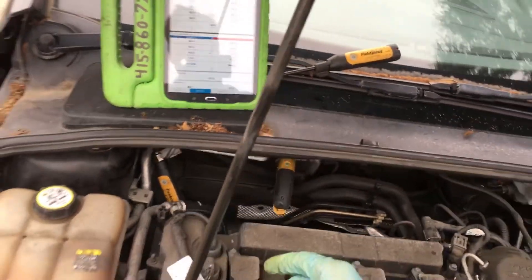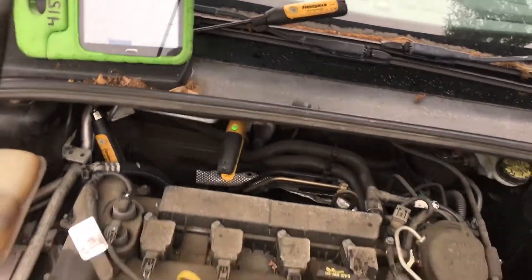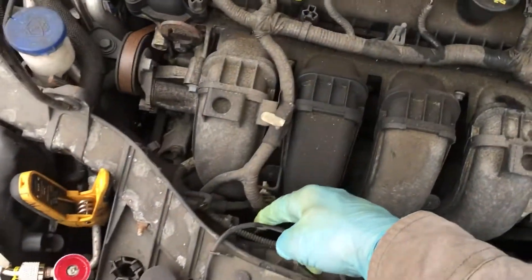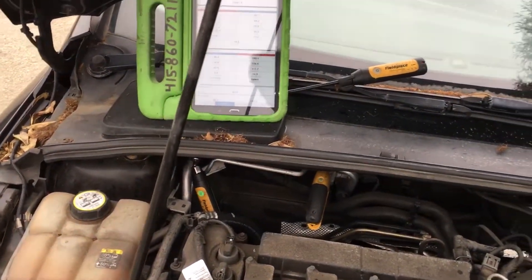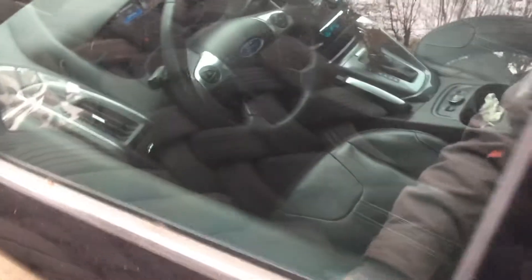Usually I'd stick them inside, but I'm not doing a diagnosis right now — I'm just doing a test. As covered in the last two videos, this line was broken for two years, open to the atmosphere, so the system is saturated with moisture. The oil is just laden with a massive amount of moisture in it that could not be removed.